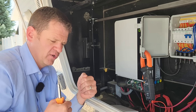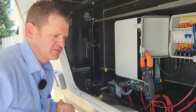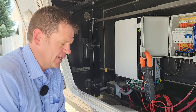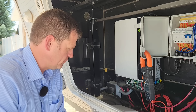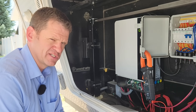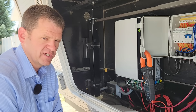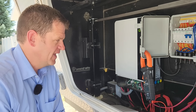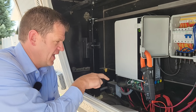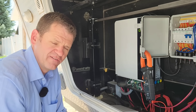It felt like one of those medical defibrillators — came right through the chest. It was the worst shock I've ever experienced, and I think I got really lucky. After I came to myself, I wasn't sure what had caused it. Fast forward a few months, I was watching a video from Will Prowse — thanks Will — and he mentioned there is a shock hazard with these units: 120 volts AC can come down the PV terminals when the inverter is on.